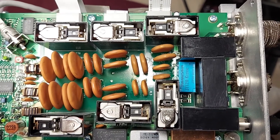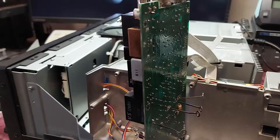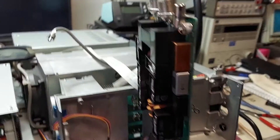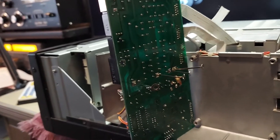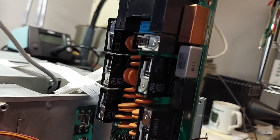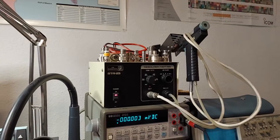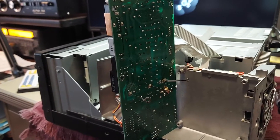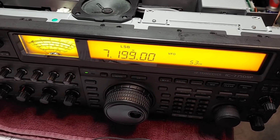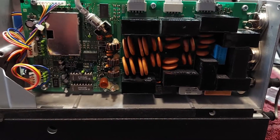I'm going to carefully tear this apart and remove those relays and take the next step. It was a little tricky getting that out — there are some pass-throughs you have to disconnect on the other side of the antenna tuner. I've checked power all the way to the suspected relays and there's power going all the way there, so there are no broken traces. I'm warming up my desoldering station and we're just going to replace those two relays and keep my fingers crossed.